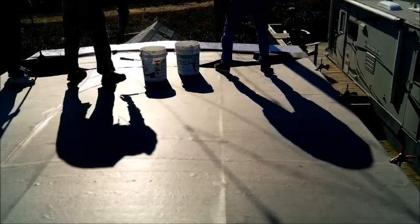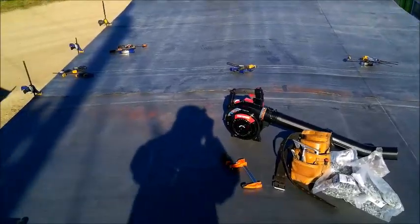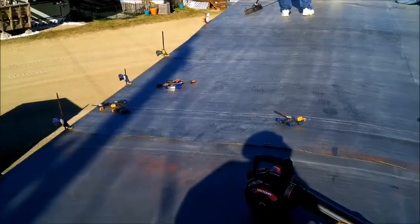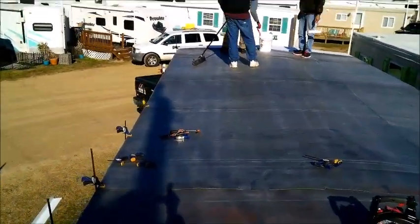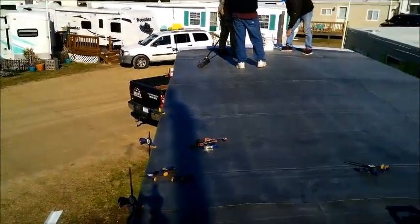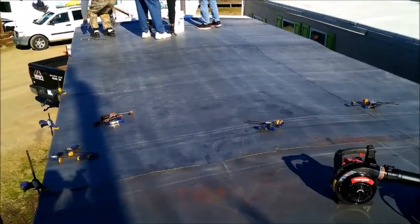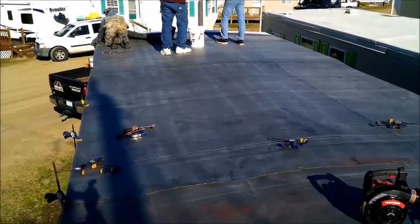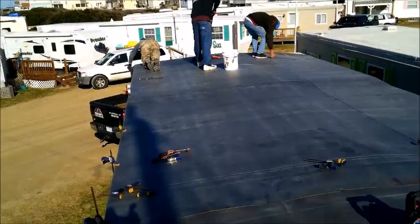We've got all four of us up here, so that's sweet. That's looking really good, guys. Tricks of the trade, which is a clamp of a couple of feet, especially on the belly side. Not so much over there, but over here. As you pull your rubber out, clamp it down, you've got wind. And you could be worried about a snow load on top of this, if your trailer was going through the wintertime with snow loads getting on top of it. When you put plywood on it and rubber, it's going to hold three times the amount of snow.